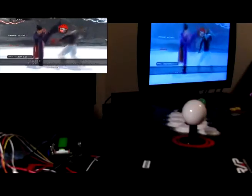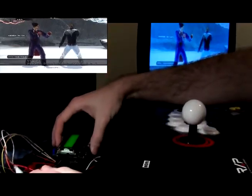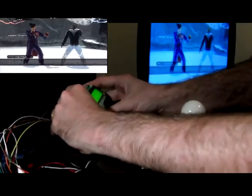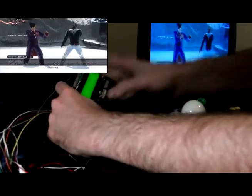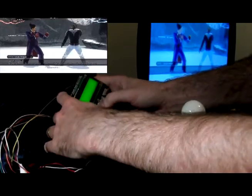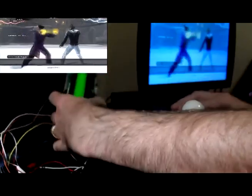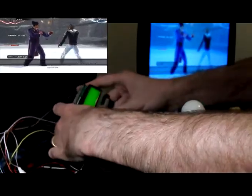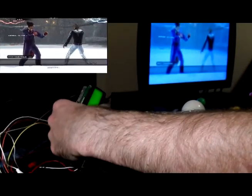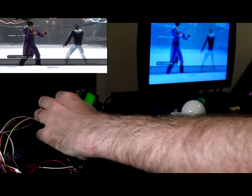It's just a normal joystick — it will record for 360 frames across eight buttons. So you can press a button when you're in mode zero and it'll record something. You can scroll up and down and see what's recorded for each frame. So it's just noted that I've pushed all four buttons on frame one. And we can go to mode one and just clear that and play it back. That's one frame each — the timing is pretty tight. So that's the first two things it does: you can input commands and record them frame by frame, and you can play those back.